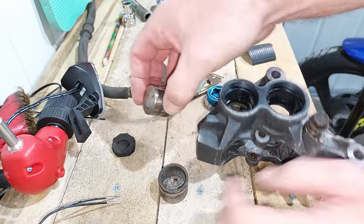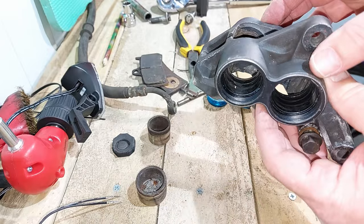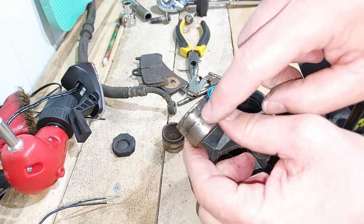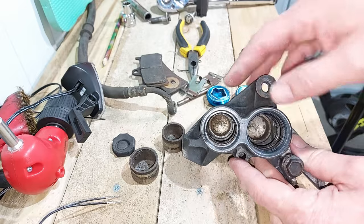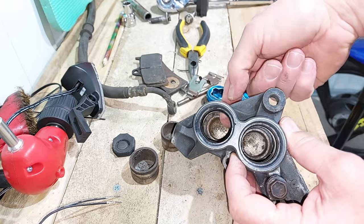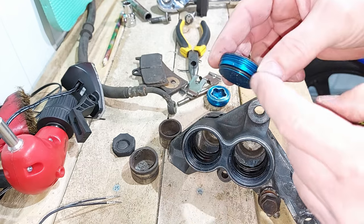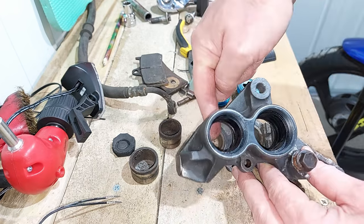I got both pistons out - the large one and the small one from the top. If you feel the rubber on this one, the rubber seals have started to deteriorate and they're stuck to the side - that's what was keeping it in. We're going to have to put a new rubber seal set in there. There should be an outer dust seal and an inner main seal - we'll be replacing them, and I think we'll have to replace the o-rings as well.